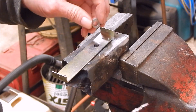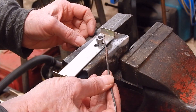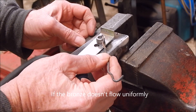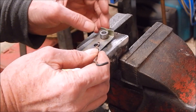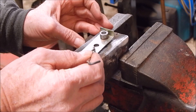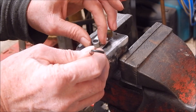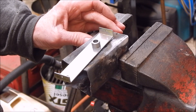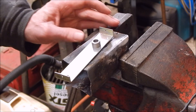When you put the bronze on initially to key it, I always use a little bit of wire — I've got a bit of wire I've used a zillion times. Once you get your blobs of bronze on, you then move it around, work it around so you can spread it without putting too much bronze on. You do the same here — get a couple of dobs of bronze on the job and then move it around with your wire, then use long nose pliers to put it together, and then you just do the final reheat. So that's what we're going to do — it's quite simple really.